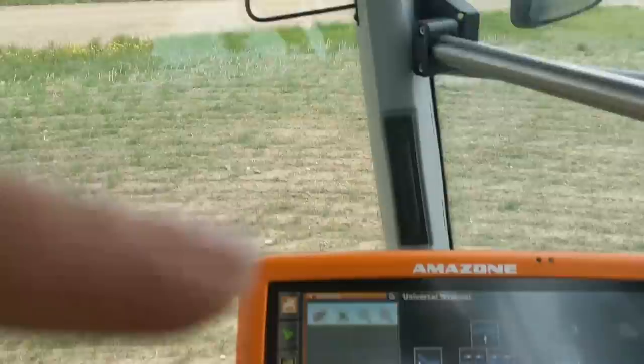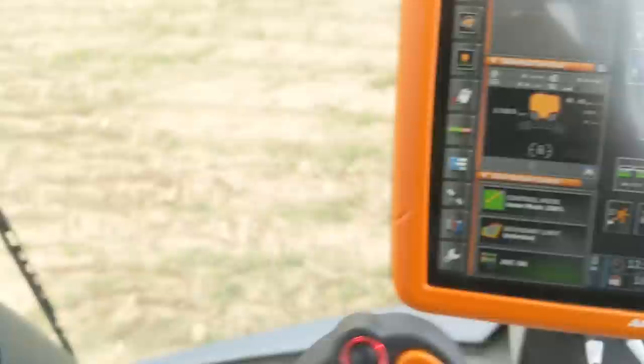And then on this button, I have the product switch, okay? And the auto steer is either this, which is, oh yeah, oops, right, I hit it. Which is either this button here, or you just have to physically hit it down here. So that's kind of old too, because I would like to have my auto steer button programmed into my joystick. I don't want to have to hit a trigger on the floor, and I don't want to have to hit the button on the screen. So that's how you can set this thing up however you want to.